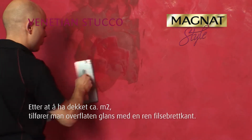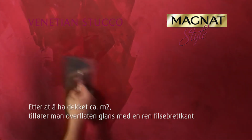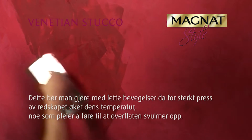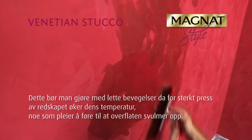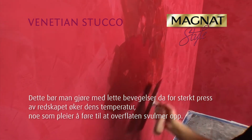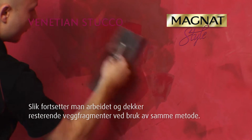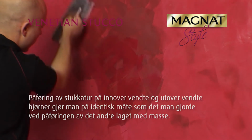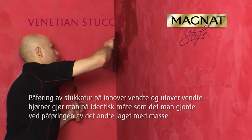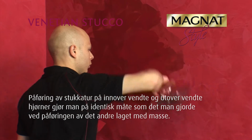Having coated about 1 square meter, polish it with the clean edge of the float. Do this in very light passes. Excessive pressure on the tool may heat it from friction and result in coat swelling. Continue in the same way to coat the remaining patches of the wall. Apply the stucco on inner and outer corners like you did with the second layer.